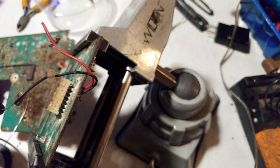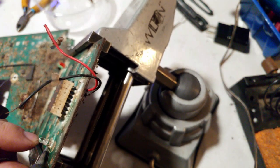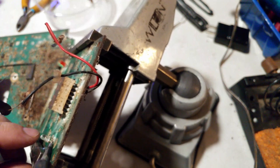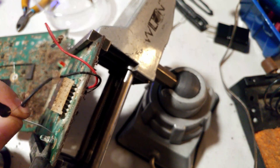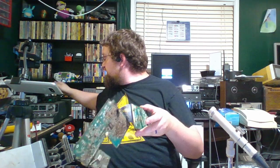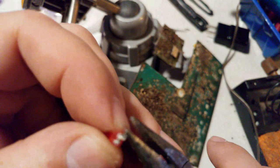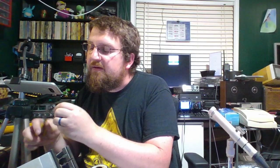Let me get this loose. I'm going to add just a little bit of fresh solder to see if that helps loosen this up — what's there already is pretty corroded. So whatever solder is in here is so corroded I'm making no progress with it at all. So instead of using the soldering iron, we're going to try some mechanical removal. Using these pliers — just went ahead and pulled that LED right off, just grabbing whatever solder was on there. Squeezing and it's falling right off.